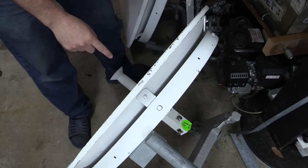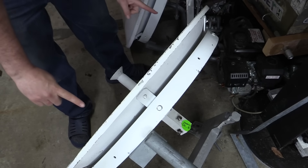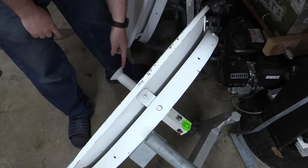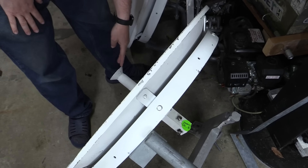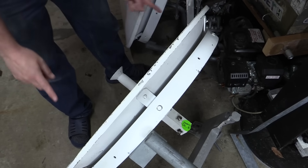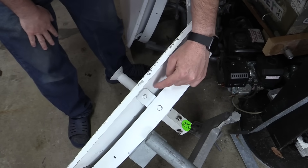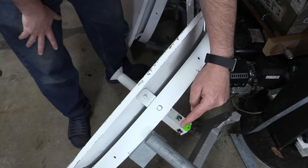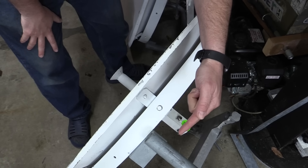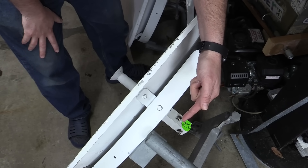You can kind of see both sides of the feed here. The parabolic dish acts as a reflector so incoming signals get bounced to this centerpiece. This is a secondary reflector because this is what's called a Cassegrain antenna. The actual receiver is back here — the signal comes in, gets bounced to the secondary reflector, gets bounced down this hollow tube, and then goes to these little pickups or active elements in the back. There are two antenna ports because this has two polarities available: horizontal and vertical.